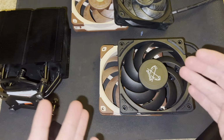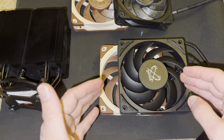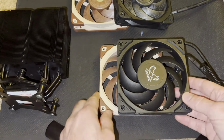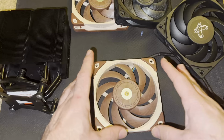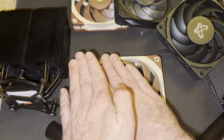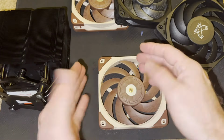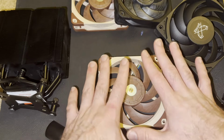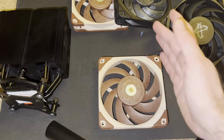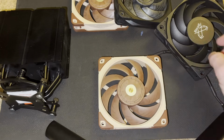Now, you might be wondering why the experimentation for counter-rotating fans. That is because it's basically an efficiency thing. If you have one fan, in order for it to generate pressure, you need to have overlap between the two blades so that air can't basically escape back out around it, and that helps create a sort of pressure seal. As well as blade distance to the edge of the housing. All those are factors in terms of the overall blade design.